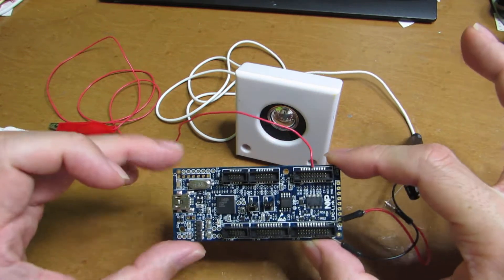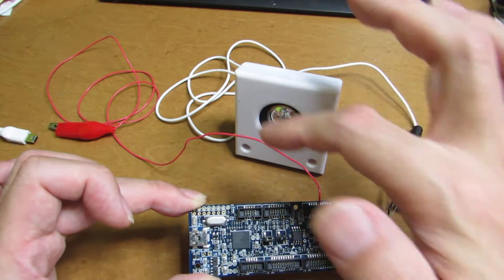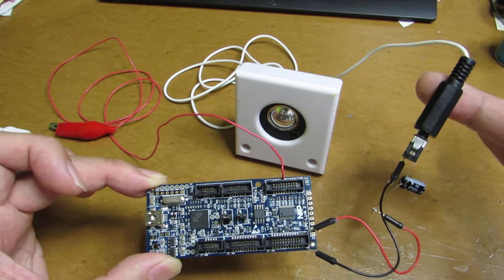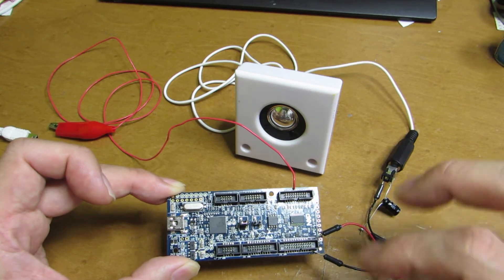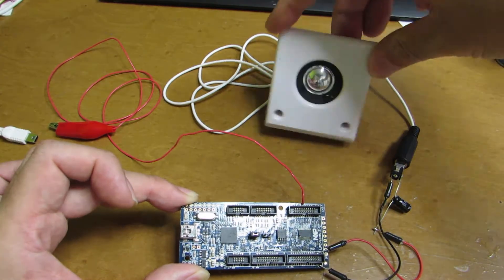Now let's see how it works. It connects to some lead wire which acts as an antenna, and I just connect the audio output from the GPIO. The sound is generated using PWM by fast GPIO switching, and here is a passive speaker.